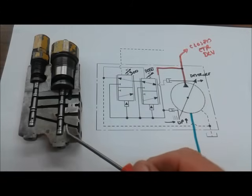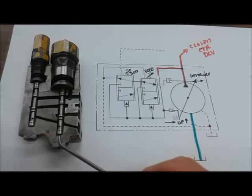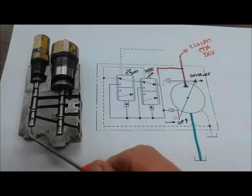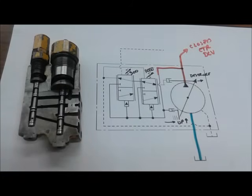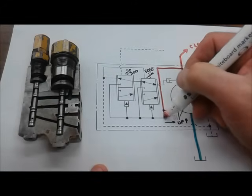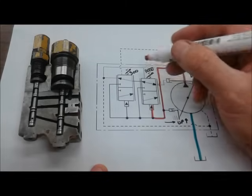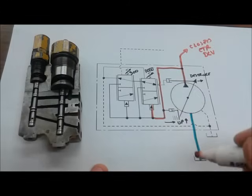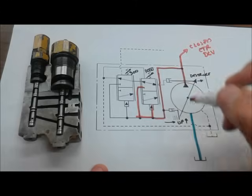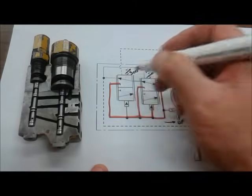in here. And there's a hole in the pressure limiting compensator spool where it can come in to push in the bottom. It can also come through this drilling and into here and push on the bottom of the margin or load sense spool. So whatever pressure that builds to can try and push this valve up. Of course, it's got a big, heavy 3,000 PSI spring here, so it's likely to stay down, but the pressure will also sit on tap at that valve, and it'll also sit on tap at the load sense valve.